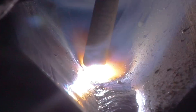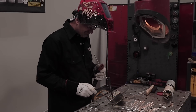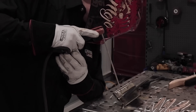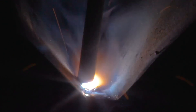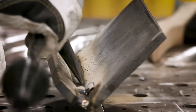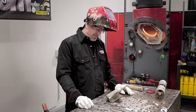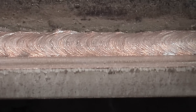Getting half that bead, covering it up — I'm not going to make the whole rod this time, so I have to pull off. I initiate the arc and when I go to tie in, I just do a quick little C-formation and get right back on that stainless side. The tie-in looks really nice, the profile looks good, it's tied in really well to the stainless — and now we do the carbon side.